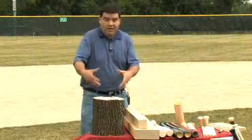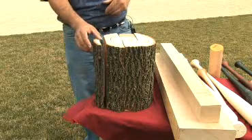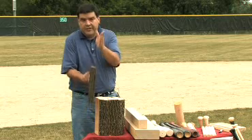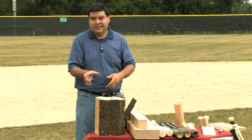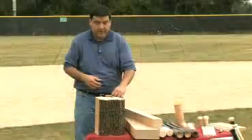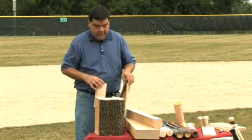What I have here is basically a log of hard maple, sugar maple. And what I've done here is I've actually cut it up very similar to how it's cut up in the sawmill. They make a first cut, opening up the face, so they can then tell what quality of wood they have in this log. Their first cut is always trying to be very parallel to the outside bark. Their next cut is a three-inch cut, slightly over three inches, and so they have a large slab. They then have to cut squares out of that plank, and the most important thing is to cut parallel to the bark.